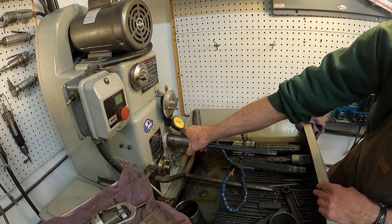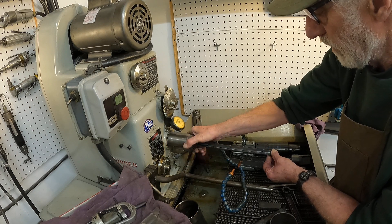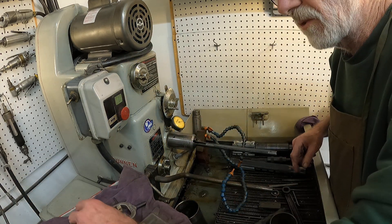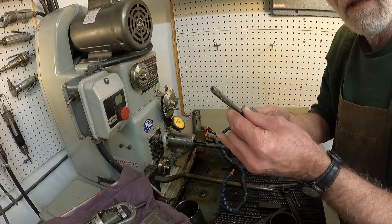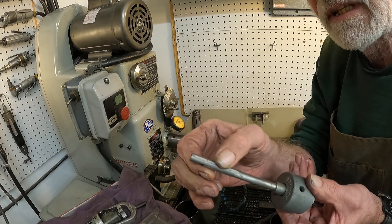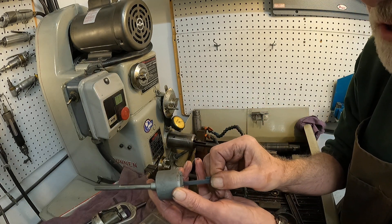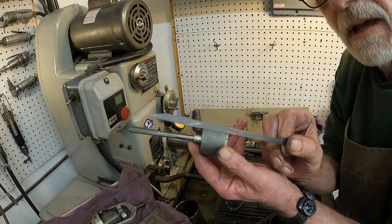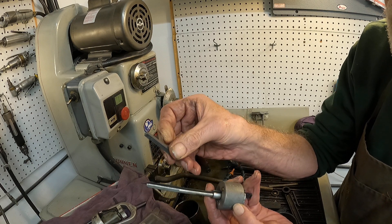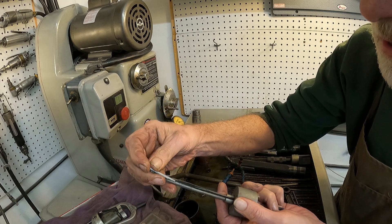The part I have to do — and luckily I already have a mandrel for it — is for my milling machine. Here's that mandrel. On the smaller ones, here's a very small one, I think that's three-eighths inch, so the shoe is built right into it. Here's the stone and here's the wedge — I'll pull the wedge completely out so you can see how that works. The stone just pops out like that; it's got its little hooks. These single stone mandrels are basically all like that.